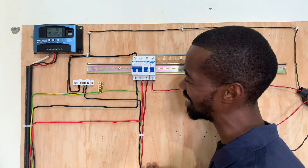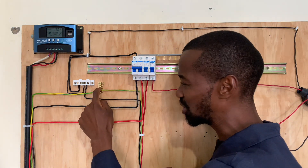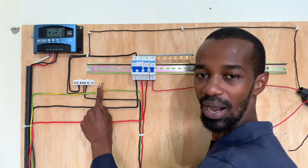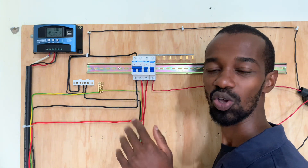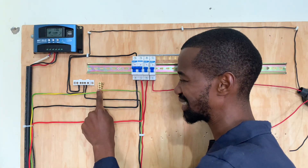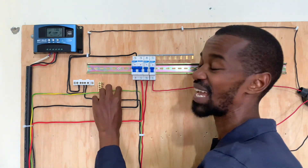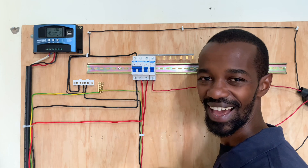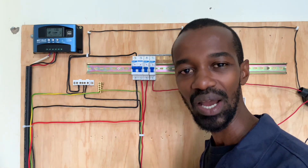Another important connection is the earth connection. The earth connection from the meter box goes direct into the consumer unit, where it connects to the bar referred to as the earth bar. From this earth bar we have a connection for our socket directly. For my lighting provision I only have two connections — the neutral and the live — so I'm only connecting the socket with the earth connection. However, in an ideal situation it is important to connect the earth connection to the lighting system in case the lighting fitted there has a connection for the earthing wire.